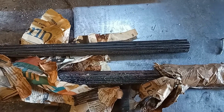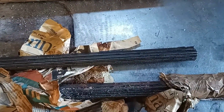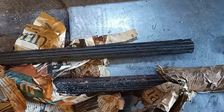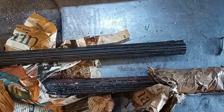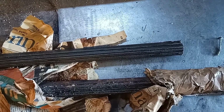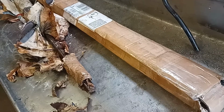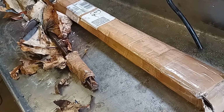I have several sets of VW ball joint torsion bar leaf springs. These are full width, of course, and I'm going to cut them down so that they're much shorter. Now, as they get shorter, their spring rate will increase. I believe overall the spring rate for torsion leaves is linear, but I have to test the torsion leaves to find the spring rate so that I have a good idea of how short I need to cut them. I'll check all of this with a torque wrench to see how many degrees of movement I get on the torsion leaves for a certain torque on the torque wrench.